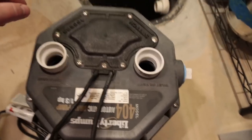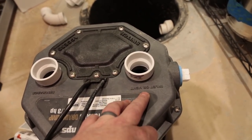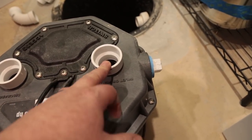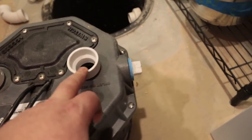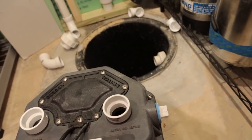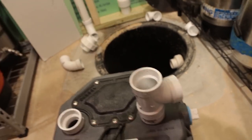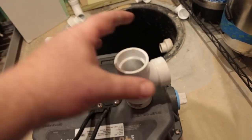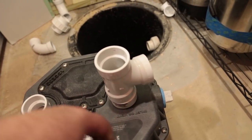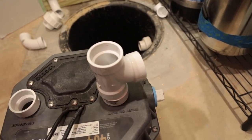In the storage area, here's the lift pump. There's an inlet side — or a vent side if you will — and then there is a discharge. I've got the inlet on the top and I plugged off the side here. I'm actually going to do a T in this and put another one of those vents up on top of the T so I have double ventilation, making sure this thing doesn't suck water out of the P-trap for the floor drain or the sink.